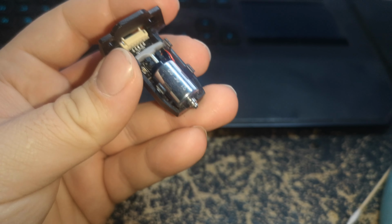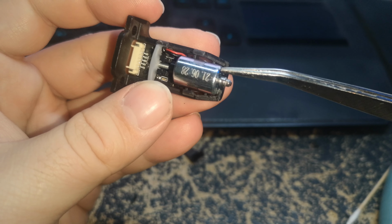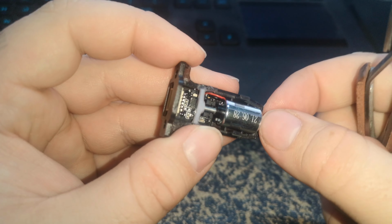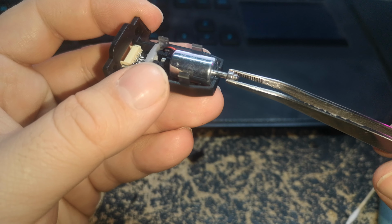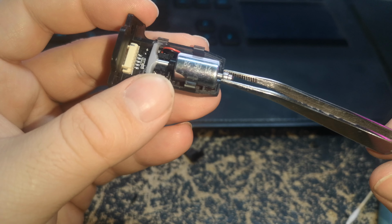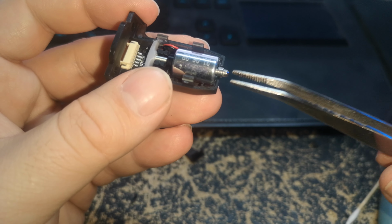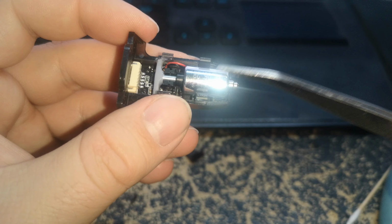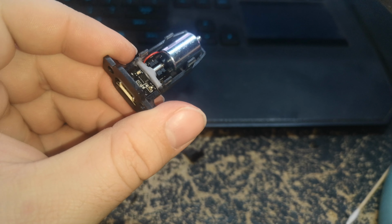Other ideas that I sent to E3D. Make a polymer body for the solenoid. That way this doesn't have metal to rattle against, or a polymer thing there. If I had more of these, I could experiment and cut one of those apart or try to insert some sort of plastic disc there or something. I might try something thin like that. I tried with electrical tape, that didn't really seem to help. And this is a sealed unit, and these are $75 a pop, so I'm not going to mess around with that and take that apart.